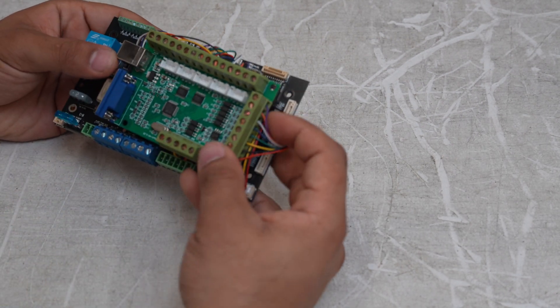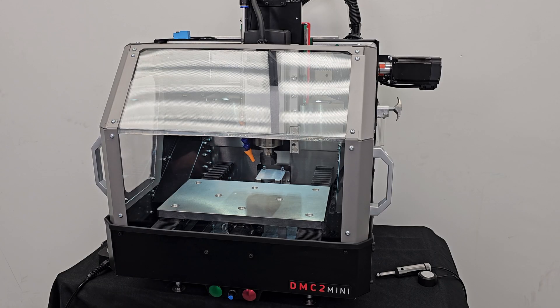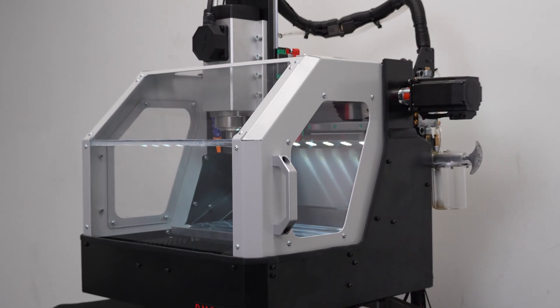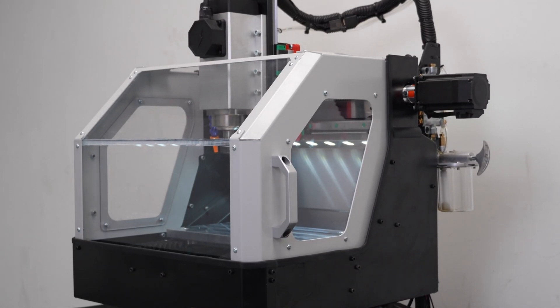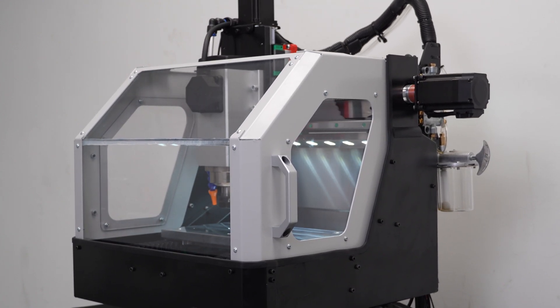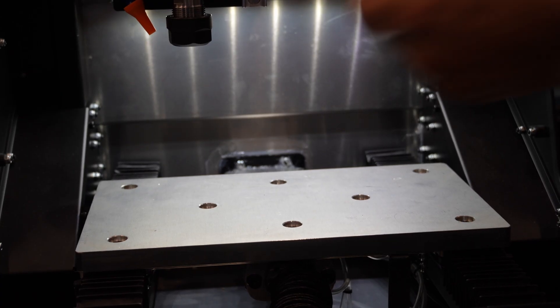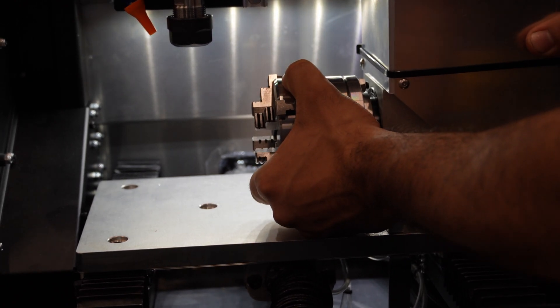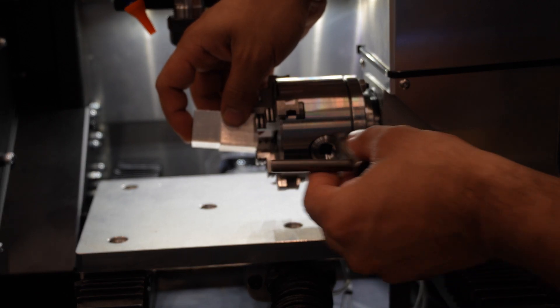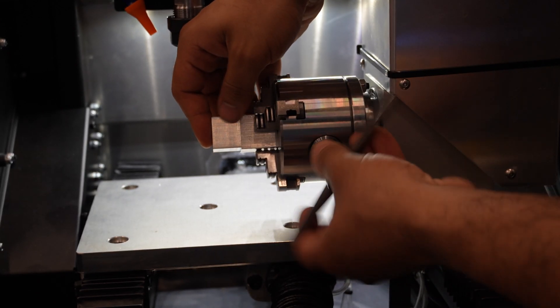At the front of the machine we have an upgraded coolant cover. This cover has thicker 4 millimeter plastic windows that are much more rigid and can take a beating, and the cover itself is also way taller — up to the top of the frame of the machine — which helps to keep chips and debris in since the top has to remain open for the spindle to move across. The taller cover means there's a lot more space above the bed to allow for the 4th axis to fit and not consume any Y axis travel. More on that in a separate upcoming 4th axis video.